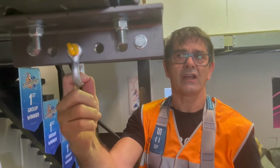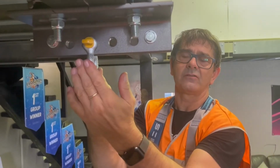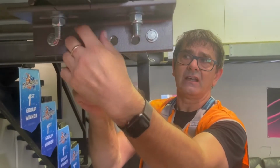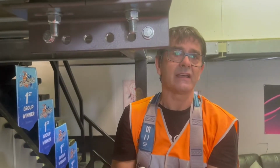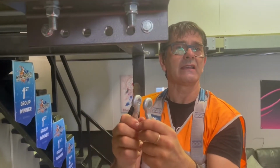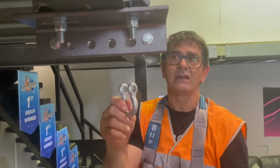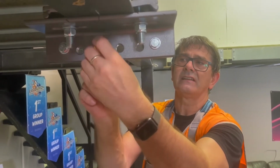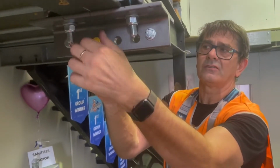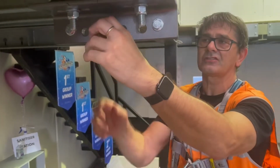At this point, we're ready to actually hang the gear off our beam clamp. We already have our 2-ton shackle in place. It's time to remove that if necessary. And for instance, we might want to hang a swivel on the bottom of this before we put it in place. There could also be an omni pulley block of some sort if we're using a pulley system. Nonetheless, you'll then replace the 2-ton shackle with your gear hanging on it. And remember to always put a mouse on to your shackle pin.